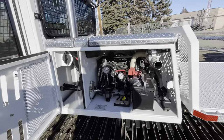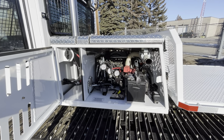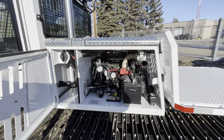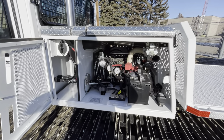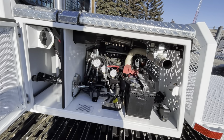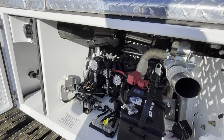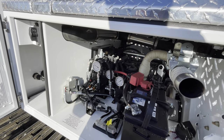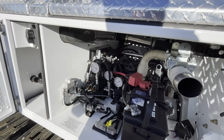Inside the engine compartment here, it's powered with a 74-horsepower turbo diesel. We use stainless exhaust and stainless intake, and a good-sized battery. You have full access to all the hydraulic valves. The machine has automatic track tensioning — there's a valve that controls the track tensioning as well as the pilot control for the machine.